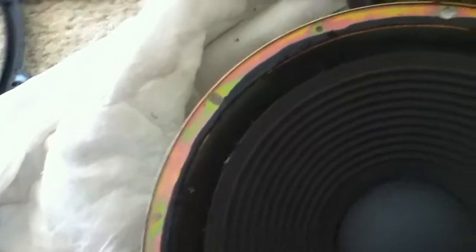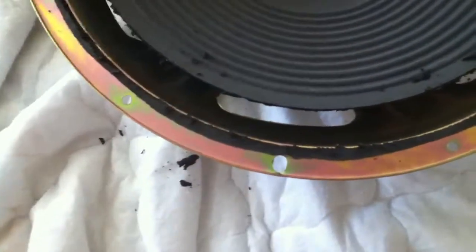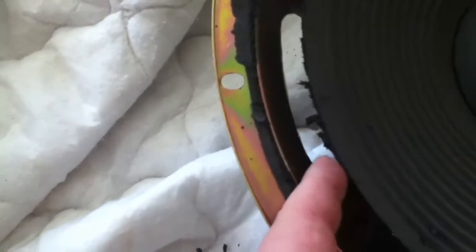As you can see, when they originally put the surround on, they kind of slap-dashed it on there — it's not really clean, but it did work. We're going to remove all the black original surround from the edge, and all the underside of the cone has to be cleaned off. We're going to be gluing to the underside, as the original was glued to the underside.